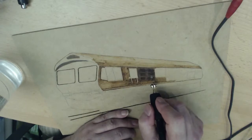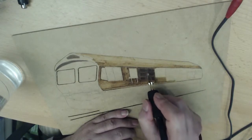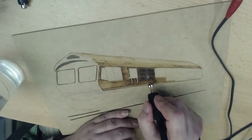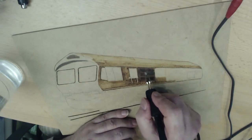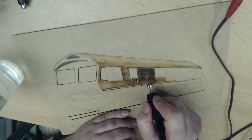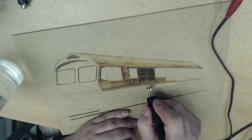What I'm doing now is trying to smooth out what I've been doing. What you're actually doing with pyrography in this style, in heating the wood, is causing the sap that's in the wood to be extruded or leaked out, and then it actually gets cooked by the heat of the tool,